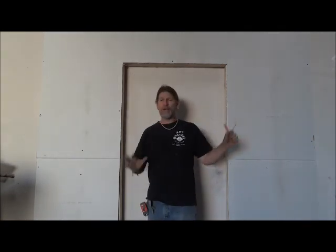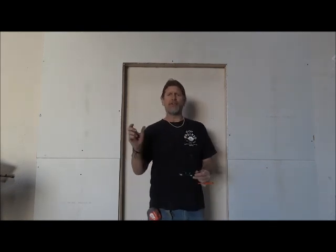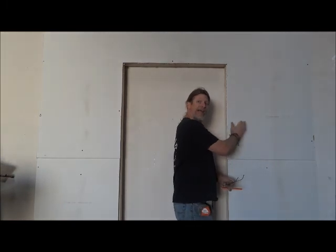We're back to square one — drywall is back on, and we know the studs are behind there. We know we've got header blocking going from left to right the entire distance. But for those of you who can't take off your drywall or are working with an existing wall, run to your local hardware store and buy yourself a stud finder. For probably five to ten bucks, it's a little device that you run along the wall and as it finds a stud, it will beep and light up so you can find exactly where those studs are.